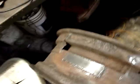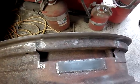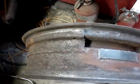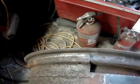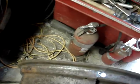So tomorrow, since it's getting on to about dinner time, I will make this patch, heat it into shape, and get it mounted on here. I need to find my Bondo and start patching the holes and smoothing the edges. There might be a couple more spots along here that I want to tack — if this is loose and you put Bondo on there, it'll just crack and come out, and then you'll have sharp pieces of Bondo rolling around inside the tire. We don't want that. So if there's any loose spots, I'll tack them. This side will be held by the tire, but if there's any real bad spots, I'll tack those too.